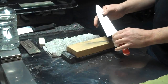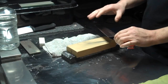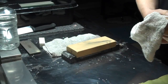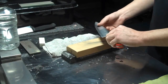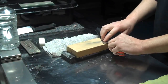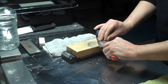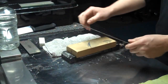So that's the basics of my technique and holding consistency in the bevel: you just want to focus the forces that you're applying to the blade on the edge and the edge itself. Kind of take and separate this edge from the whole rest of the knife and just imagine that edge laying on the stone, kind of a triangle shape laying on the stone. And the bevel plane, the side that is laying on the stone, you want it to make as even contact at all times as possible. So by giving a little twisting in the blade to hold it there and supporting it with your fingers, pinpointing the pressure along the edge, grind the edge very precisely from the tip to the heel on each side.